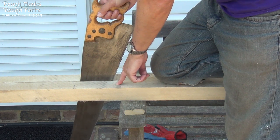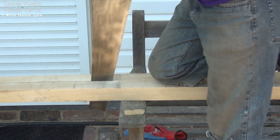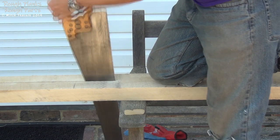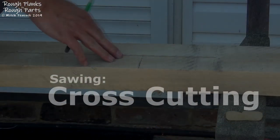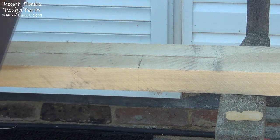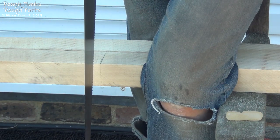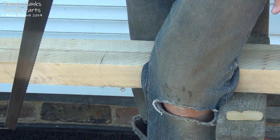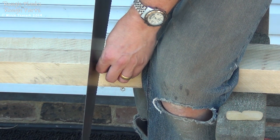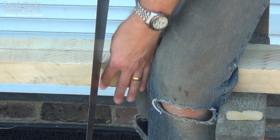As you reach the end of the cut, you want to come up perpendicular so you don't rip into what might be stock for your next project. Although none of these are perfectly square or flat, it's worth squaring a line down as a guide for when we cut this section out. Different ways of supporting it — for something this size I clamp it between my legs with it also down on the bench. Start the cut with good body position: a straight arm between hand, elbow, and shoulder, and I can see both lines down the front and along the top.